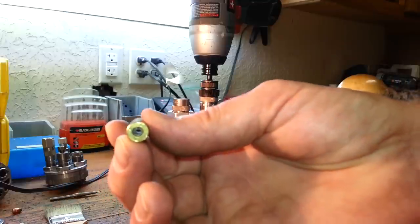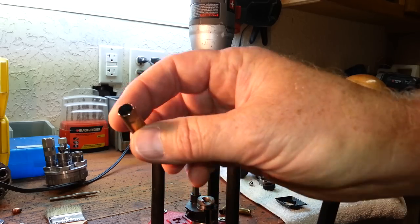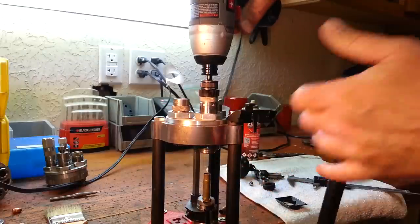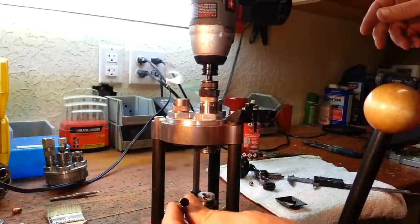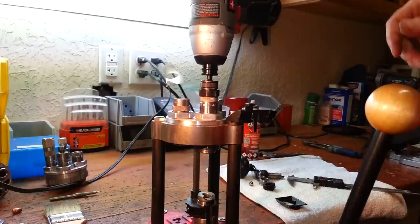I went through and timed myself, and using this system I can do about 100 pieces in about 25 minutes from start to finish — that's cutting on the chop saw, sizing it, and then trimming to final length. What I would say is, as you go along and you're doing these, go ahead and throw them in the bucket, but before you reload them, measure each one. If you do get one that's too long — over 1.368 — you may actually run into some chambering problems and not be able to go fully into battery. I want to make sure you take care of that.